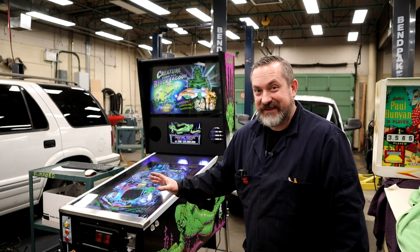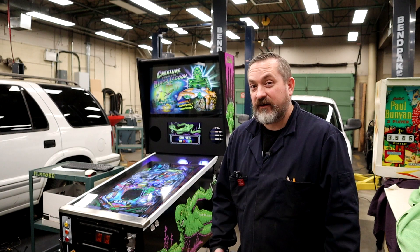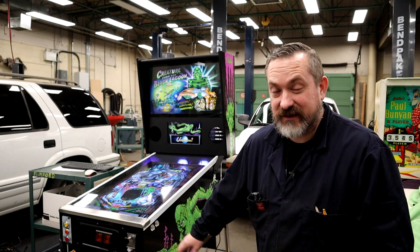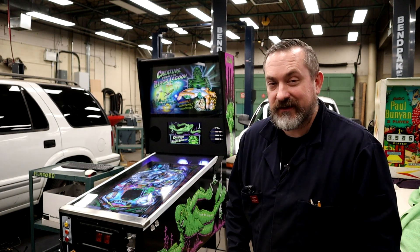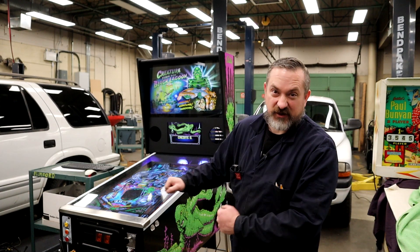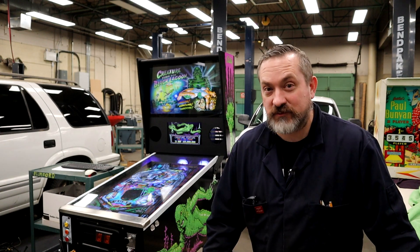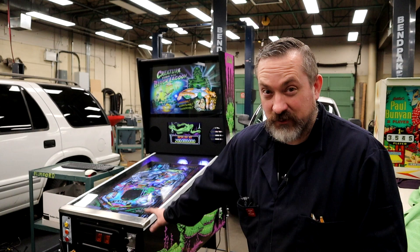I've got this virtual pinball digital nudge and tilt set up pretty nice — it plays really good, somewhat accurate. However, there are times when your surround sound feedback is going to kick in, and on special tables with really aggressive pop bumpers or shaking, sound effects can trigger your tilts. The other problem is if you crank up the tilt settings so it's not kicking out on you, you're literally shaking the cabinet and it doesn't cause a tilt. Today we're going to be installing a real pinball tilt mechanism graciously sponsored by Marco Specialties, to get all of those problems fixed and have this thing tilting just like a real pinball machine.